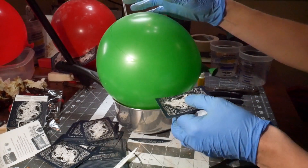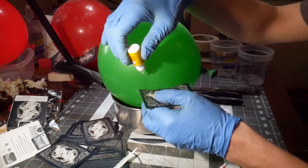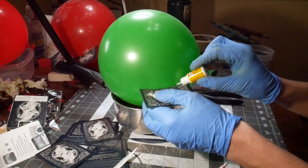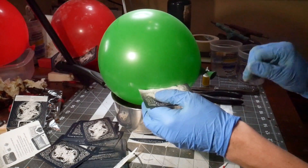To make a bronze you need a ceramic shell, and in the ceramic shell you need a wax copy balloon, and to get a wax copy balloon you need a mold. So this is the first step: blowing up a balloon and partitioning it out in preparation to make a mold.